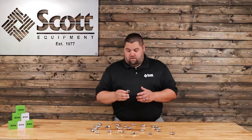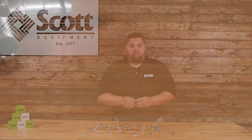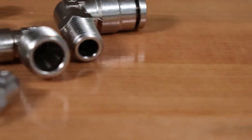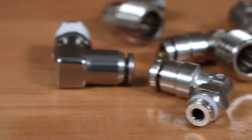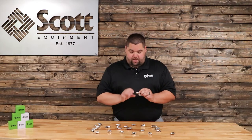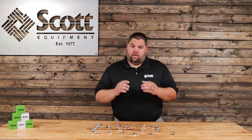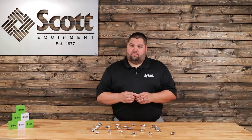The reason you may need a metal fitting: number one, they're metal — they can withstand any type of harsh environment you can throw at them. Number two, they're repairable and rebuildable if the need ever arises. Number three, they offer a fully encompassed retaining collet that does not pinch your tubing and cause extra stress like sharp retaining clips in typical fittings can.